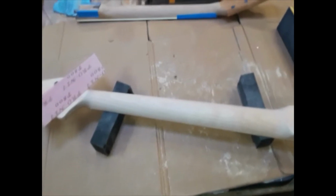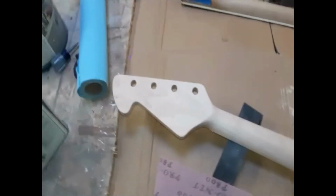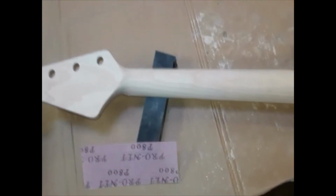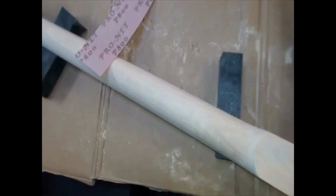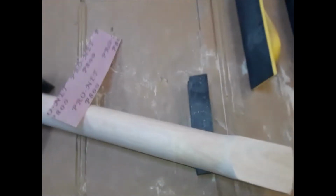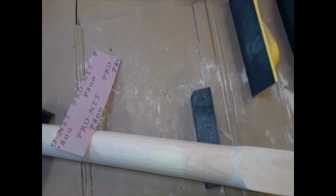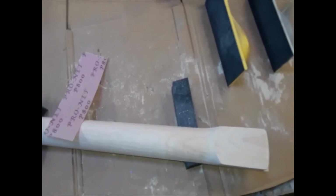Hey everybody, seeing that the Rolling Stones is on, I'm taking a break. But I thought I'd give you just a little reminder to anybody using any kind of hook and loop paper, even if it's on a power sander. Either leave sandpaper on your hook and loop stuff, so if you set it down it doesn't get damaged, or just leave it on the sides. I had a power sander that, well, we'll just say the pad had seen better days. So just a little helpful reminder.